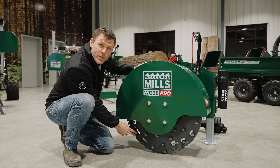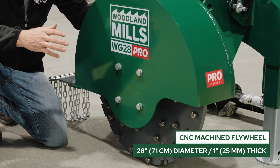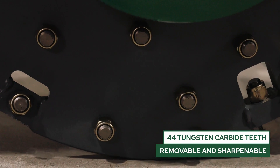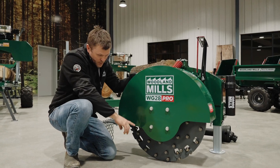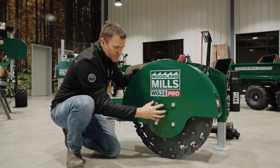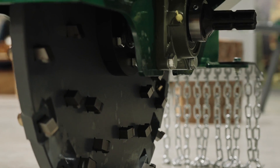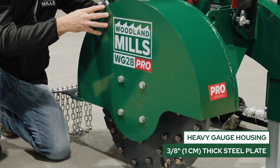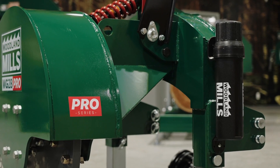Now I want to talk about the heart of the stump grinder, which is its flywheel. The flywheel is 28 inches in diameter. It starts out as a 175-pound disc of metal. It is then CNC machined with pockets and holes. We have inserts welded in to hold the teeth at various angles, and then it's dynamically balanced before it's put on the shaft to make sure it runs smooth and true during use. The flywheel runs on a 3-inch main shaft, and that main shaft is carried by two flange bearings, one tucked up in behind for protection on the face. There's a Zerk fitting with access from the side, and then the rear one is tucked up underneath from the back, again for protection to keep it out of the way while you're grinding. The flywheel housing is made out of 3/8-inch thick plate, both front and back, and it's wrapped and seamlessly welded to give it strength and rigidity to hold those bearings and keep that flywheel in place.